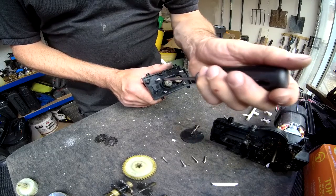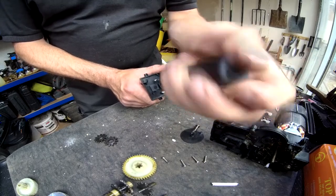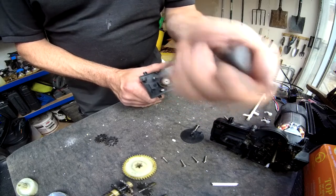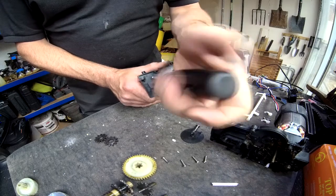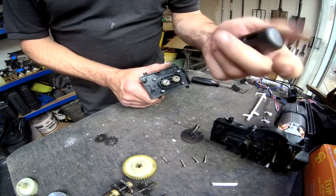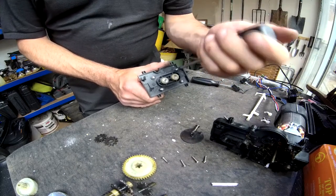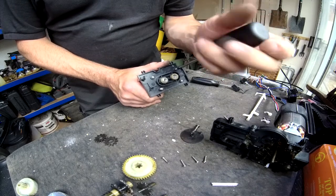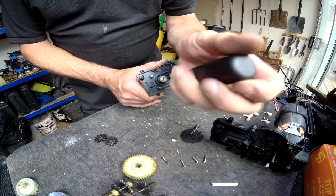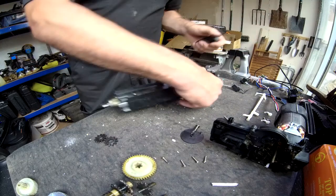With plates like this, it's never a bad idea to tighten the screws up diagonally. If they're in a circle, you do diametrically opposite and go in a star pattern. This helps to avoid jamming things up by being on the skew. That end.